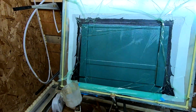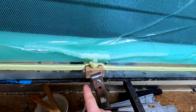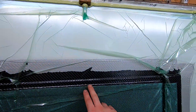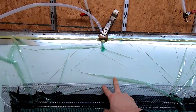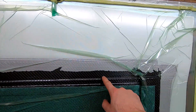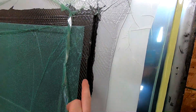The infusion is pretty much done. This is how we set ours up — it varies from person to person. We have our inlet line with spiral wrap around it, which helps the resin get out quickly. The flow net, as you saw in the time-lapse, fills fast. As soon as it gets to the end of the flow net it slows down, and as soon as it hits the peel ply — which we're using as a resin break — it really slows down. We're not fully wet-out yet at the edge, but the finished part will be trimmed just past the ridge of the core. There are a few tiny spots waiting to wet out, so we're pretty much done with the infusion.